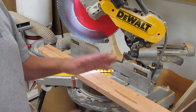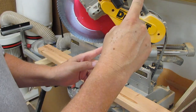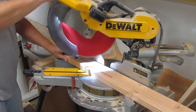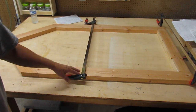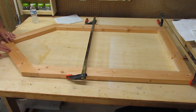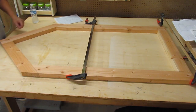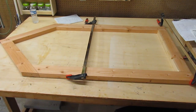Next I'm going to cut the four pieces that make the peak of the roof on each end. One will be longer — about 25 and an eighth — and the other will be shorter on the inside at 21 and five-eighths. The idea is for the ends to look like a house: the rails will attach to the base, then the gable end is made with those two offset boards. I'm going to use pocket holes to fasten all this, and glue around all the corners to keep the little ones from getting splinters.